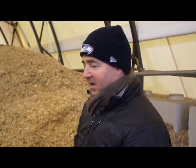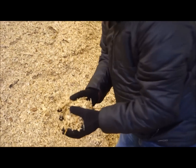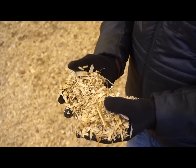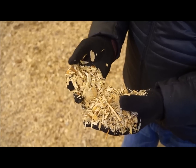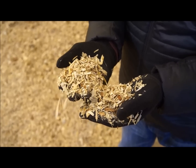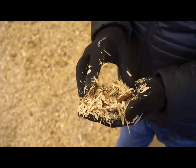I'm here in the area where we prepare the wood chips and feed them into the Torreactor. Down here to my right I've got a pile of the wood chips we were processing yesterday. As you can see it's a fairly mixed bag of pine chips — we've got some big bits in there, we've got some bits of bark, we've got a lot of fines. This has been pre-dried and what we do then is feed it into the Torreactor and torrify it.